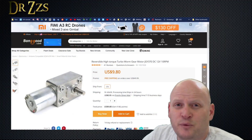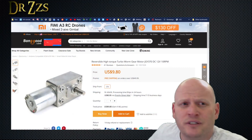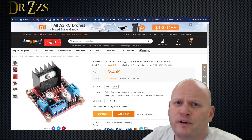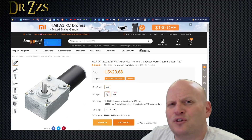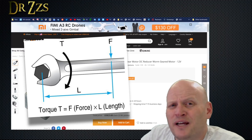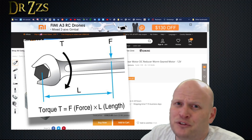I've had a lot of success lately with these geared DC motors combined with this H-Bridge motor controller. So why reinvent the wheel? Turning that little crank does require quite a bit of torque. The motor I'm using provides about 7 kg·cm of torque.